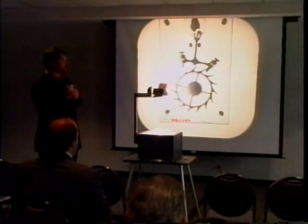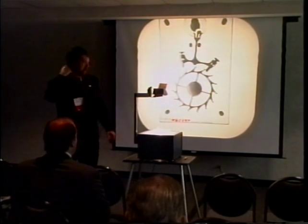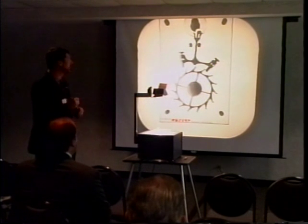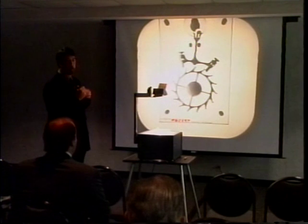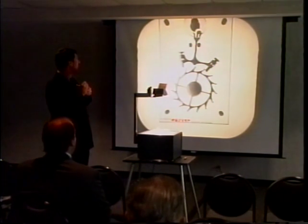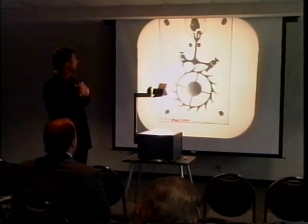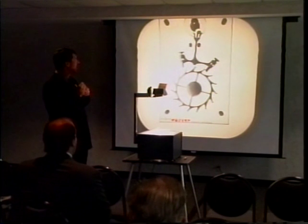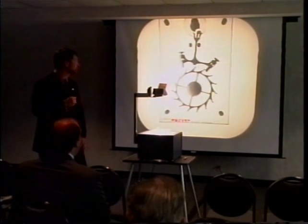roller jewel, which when we talk about shapes, there's three main different shapes you could have, and the one that you see 99.9% of the time is this one, which is called a D-shape roller jewel. And then, of course, I mentioned a roller complete with the safety roller, impulse roller, and what's this section in here called? Crescent. The crescent, very good.